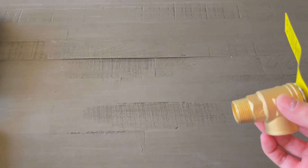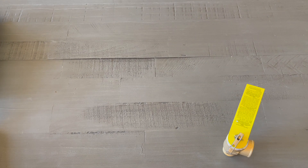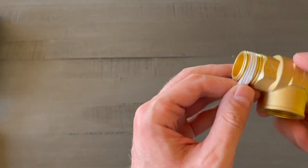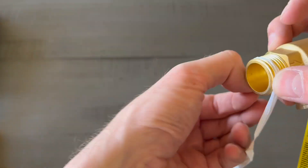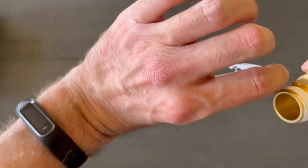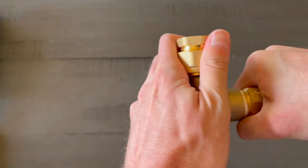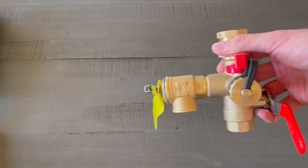The hot side is more complicated. The kit comes with a temperature and pressure relief valve. This can account for cases where you get air bubbles or the water heater gets too hot. If you do things right, I don't think this is strictly necessary on a tankless water heater, but it came with the kit, so I'm installing it anyway. As with some of the other parts, this is another metal-to-metal connection, so I'm adding even more plumber's tape. The relief valve screws into the side of the flush valve, and I hand-tightened it. You need this to end up pointing downwards, so it's not really possible to tighten it much more with a wrench.